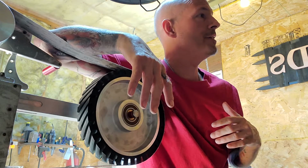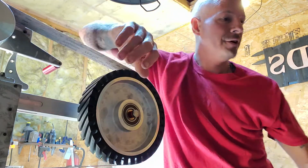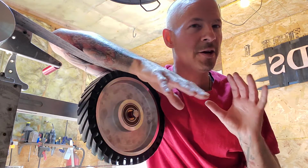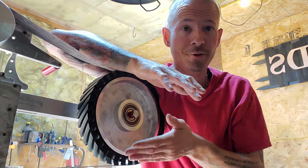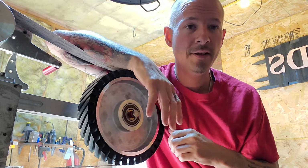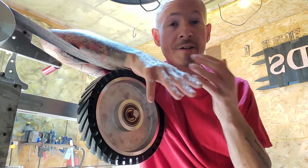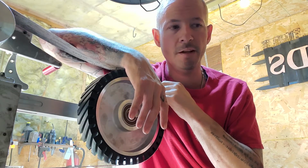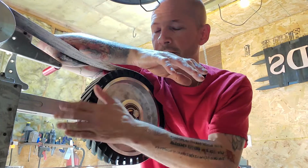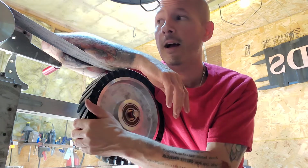And the biggest problem I had is not so much with my Trizact belts, but with some other belts I've got right here. These are 600 grit belts, and it doesn't matter what direction the arrows on the back say to put them, or how lightly I'm touching them. When they hit that back platen, they thump. So I really haven't been able to use my 600 grit belts at all. I don't think they're high quality either, which doesn't help. But on a contact wheel, because they're not meeting any real resistance, I think they'll be all right.